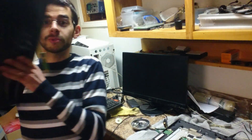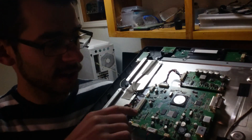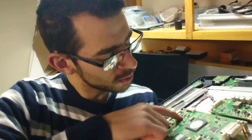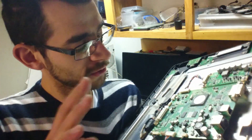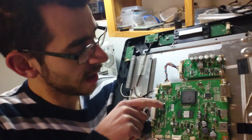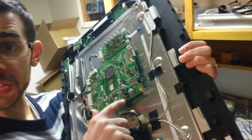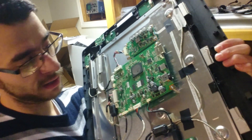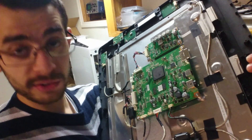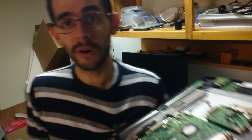So this one is open and right side up. This is the main board over here. The fix is because right over here there's a transistor labeled Q20. There are actually four of them — there's Q20 and Q18 over in this region, and then over on the other side near the input there is Q24 and Q14. Q14 is heading over towards the digitizer board. And then on the bottom is Q1. So you want to replace all five of those.